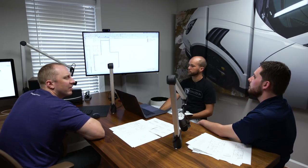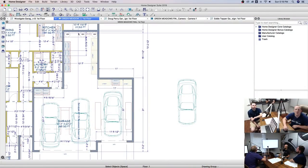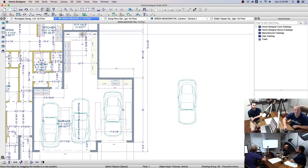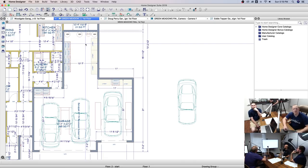Your main water line is right there — just tee off of that and your plumber puts in a tee, straight into your DI tank system. The DI tank has bypass right on it. You can even make this the centerpiece of the whole garage — put it right smack in the middle. The di tank and pressure washer would be direct-plumbed, and since the bypass is built in you don't need extra valves.